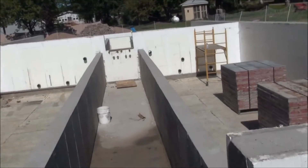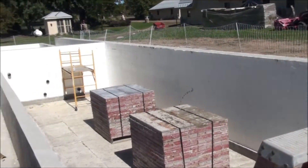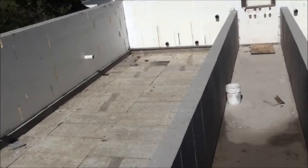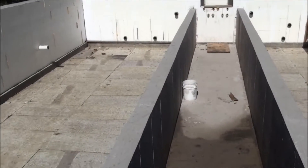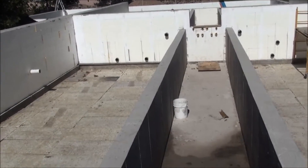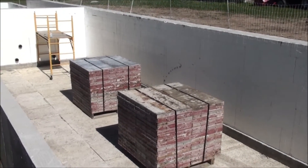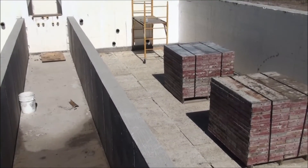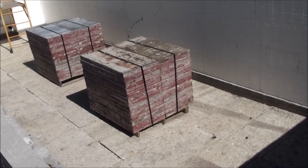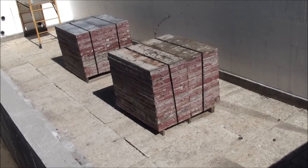I hope this shows up fairly well. This is the most southern section of the greenhouse. This is 39 foot long and 32 foot wide, and it's divided into three sections. All of these lower walls that we can see down in here are four foot walls. This will be covered with a concrete floor on this side and on this side over here. Those pallets were the forms I used to pour the concrete partition walls down in here. Those pallets are on a three and a half inch blue Dow board insulation, with vapor barrier sealed off and insulated side walls below as well.